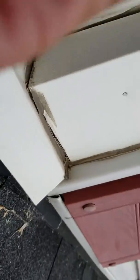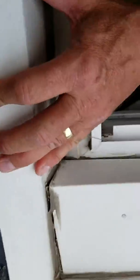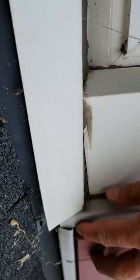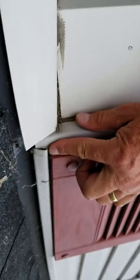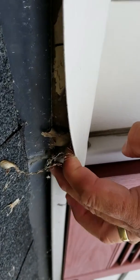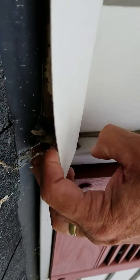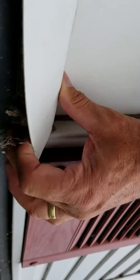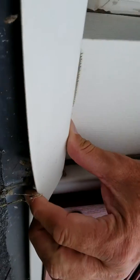We're trying to troubleshoot a leak coming down in the downstairs header. This corner of the J-channel, right where the shutter is, there's metal here that if the water's coming through the J-channel, it'll trail right down into this, right behind all this aluminum flashing. So that's one spot. You can see somebody had clear silicone and that's all broken loose right there.